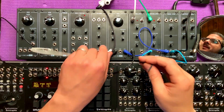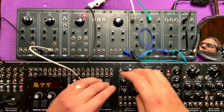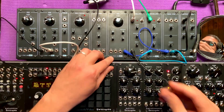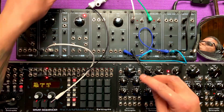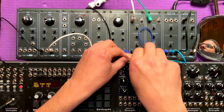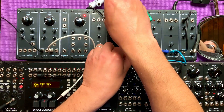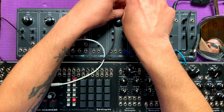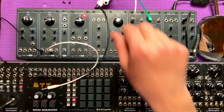So let's have a look at this filter. Let's calibrate it first. The calibration for this filter is very simple — it's a single trim pot. Since it's not meant to respond to 1V per octave, there's no tracking adjustment. The trim pot you do get is for resonance, and it determines how early in the pot it starts to resonate and how distorted that sine wave will be when it self-oscillates. So let's put this in self-resonance.